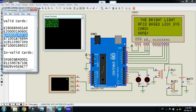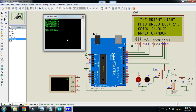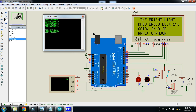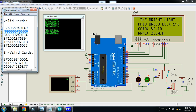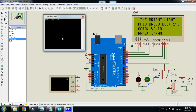The red LED and the buzzer will only turn on whenever an invalid card is swiped — invalid meaning the card is not saved in the database and not registered in the program. Here is another invalid card — let me paste it and check. You can see it's invalid, unknown, and the buzzer was also turned on for a few milliseconds. You can check all the cards; I've attached the card numbers with the link in the description where you can download the code, circuit, and card numbers. Here you can see its name is Imran and it's a valid card.